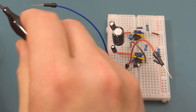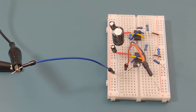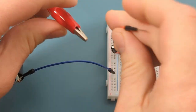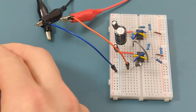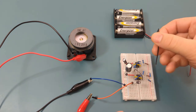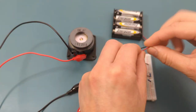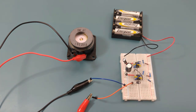Attach an alligator clip to the jumper wire. Insert the other jumper wire into the negative rail at the end of the capacitor, and attach both alligator clips to the 5-watt speaker. The jumper wire inserted into the negative rail should connect to the left side of the speaker terminal. Attach the negative lead from the battery holder to the negative rail, and the positive lead to the positive rail. We hear the police siren — the circuit is complete.